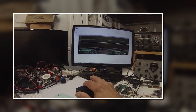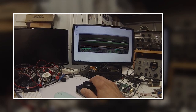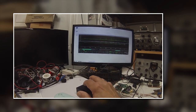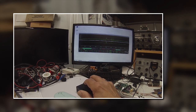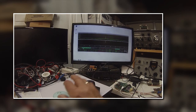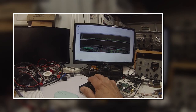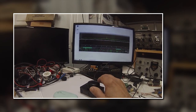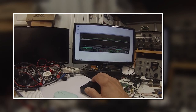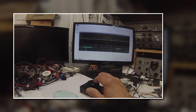Now if I put it over here on the one, it'll move in 100,000 increments — notice how quickly that moves out of the band. And if you move it over here to the megahertz, we're up to 80 megahertz — of course it can't receive at that point. Let's put it back to something reasonable. Now we're moving it up in the kilohertz range — this is 10 kilohertz tuning.